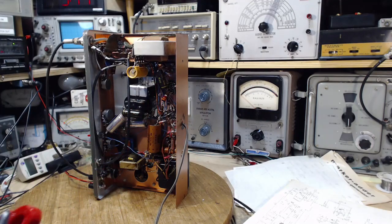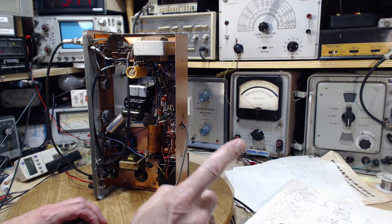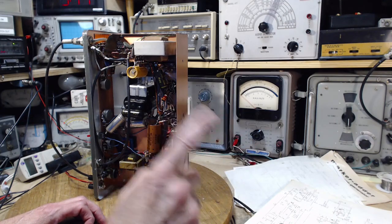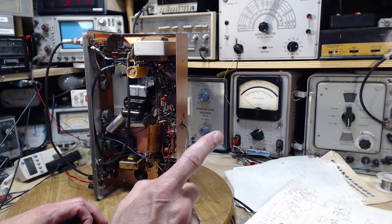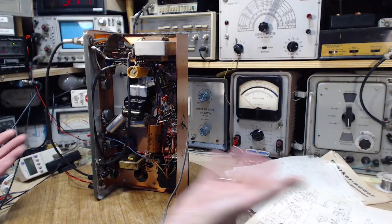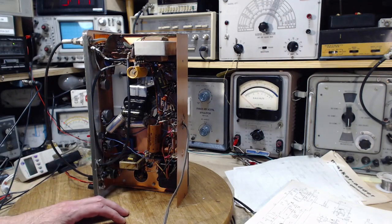And you would not be surprised if you see a variation of current. You see a DC current kind of going up and down a little bit. And that's related to the location and operation of the streetcars and subway cars on the system and how they're drawing current through all this stuff. Drawing stray current through all these water mains and all that kind of stuff.